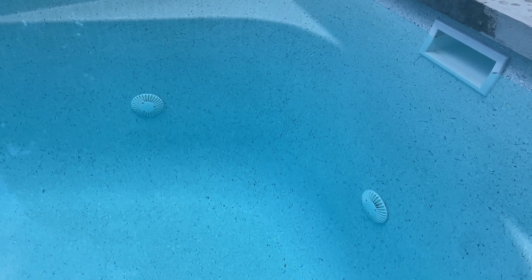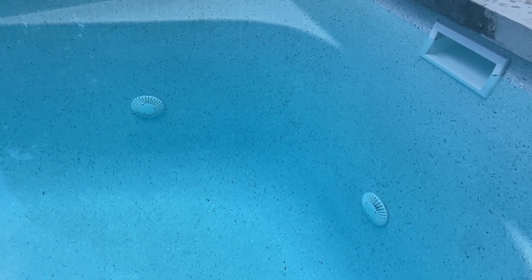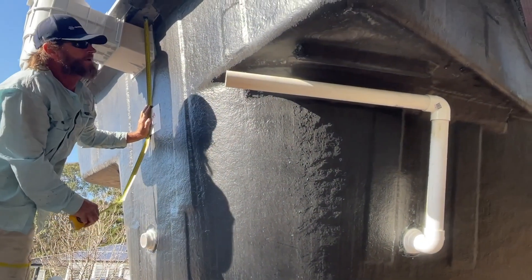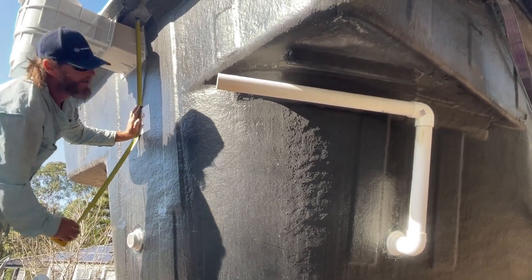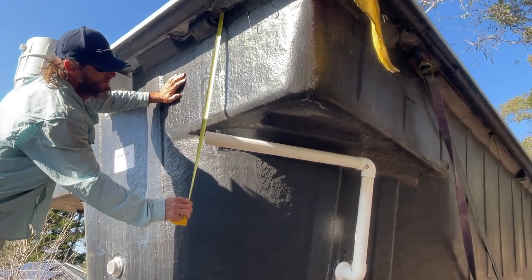This is the water source for the pump that's separate to your filtration, so you're running a circuit that is separate for your heating to your filtration. The important part with this is the fittings have to be teed together behind the pool wall and then you run a single line back to the pump, and that's to make sure that the safety feature works as intended.